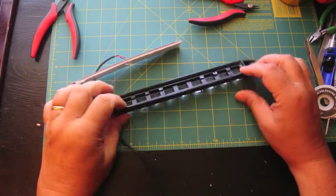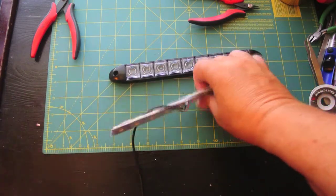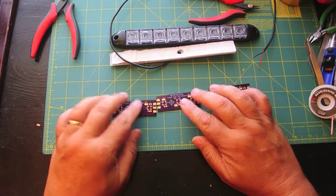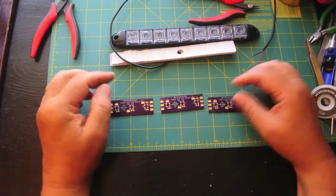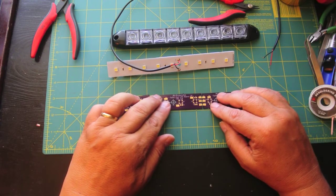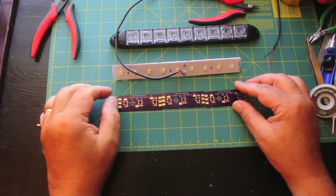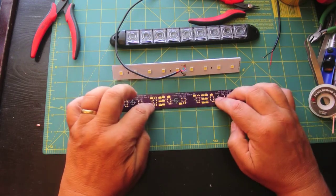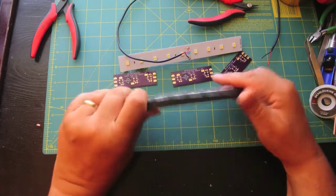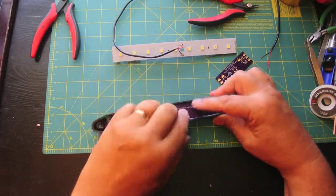On the back I was able to pull the strip off and this is what we have on the inside — just a strip of LEDs on a single, fairly flexible circuit board. I was able to find a thin circuit board like that from OSH Park, where I buy all my circuit boards. You may notice this is three strips, and since the minimum order from OSH Park is three circuit boards, I soldered the three together. We'll have the equivalent strip at one-third the price — $13 for three versus $39 for three individual ones.